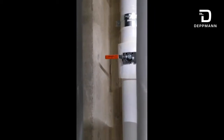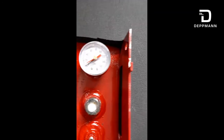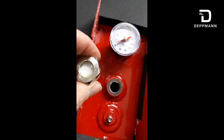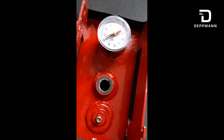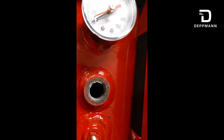You also want to shut off the valve to the tank and open up the drain valve to get all of the water out of the tank. Once you have the water and the air bled down, you'll be able to carefully unscrew this gauge sight glass from the tank, being careful because the tank could be filled with water.